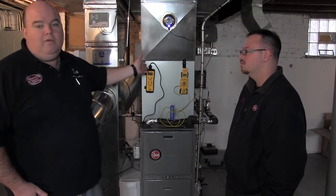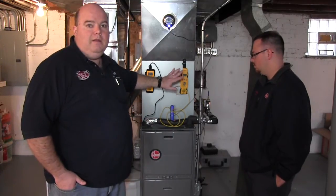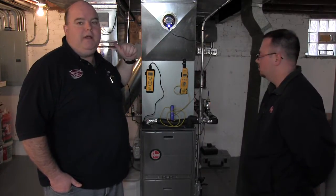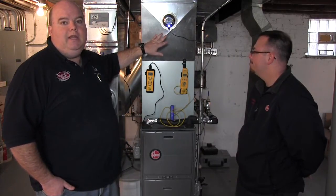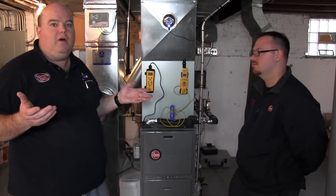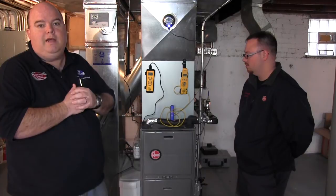What we'll do is shut it off now, turn the water temperature up, and show you the different readings and how it gains heat. Same everything — same hot water tank. I'm just going to shut this down and when we come back on, I'll turn it back up at the higher water temperature, and you'll see how we literally just adjusted the heat in the house. If this is installed and you're unhappy with it, or you get that once-in-a-hundred-years 20 days below 10 degrees, you could turn the water temperature up for a couple of days, then just turn it back down when it's not the ice age anymore.